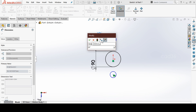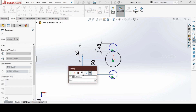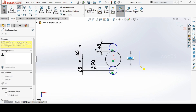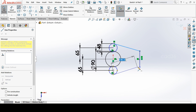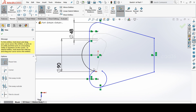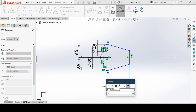This is 24 radius, so two times — both are equal. The overall hole-to-hole dimension is 130, so it will be 65 each side. Then take a line and track from the origin, making both horizontal and giving a horizontal relation. Take another line from the edge so it automatically becomes a tangent line. Trim all unwanted lines inside and out. From the origin to the end, the dimension is 128 minus 56.